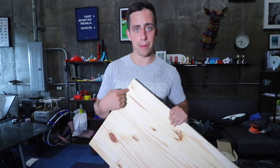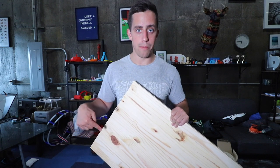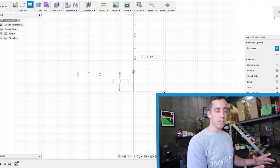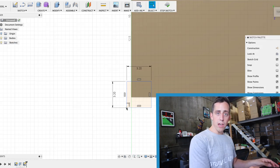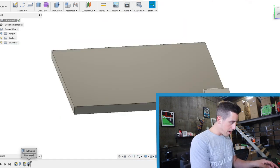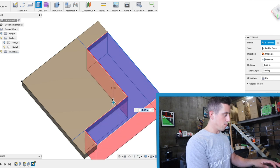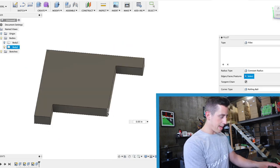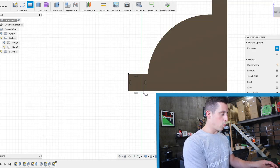Now that I have this cut, let's go design a bracket to 3D print that gives us a nice even curved edge on each corner so they all match up. I'll start by making a square representing the final piece of wood, then create a rectangle that hangs over the piece and latches onto the sides. From there we'll cut away the section we don't want to curve the angle, and add knobs on each end so it sits and doesn't go anywhere. Let's hit the 3D printer.